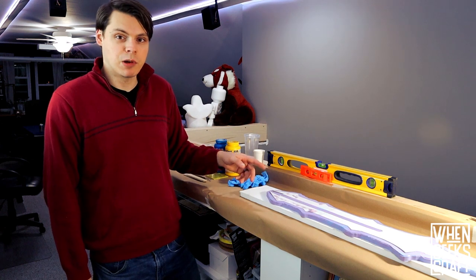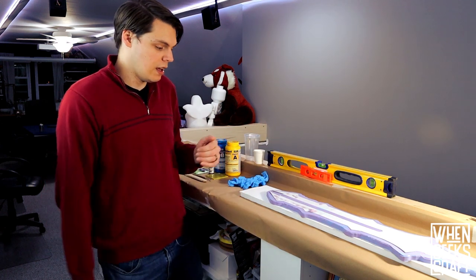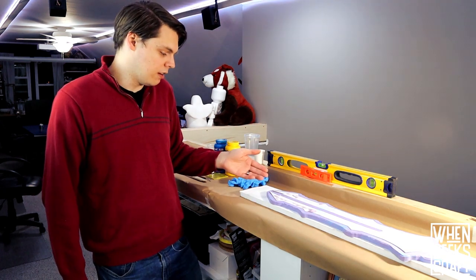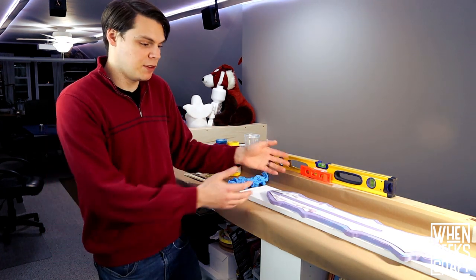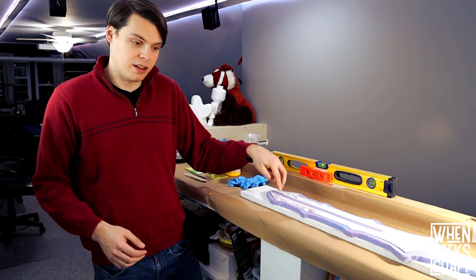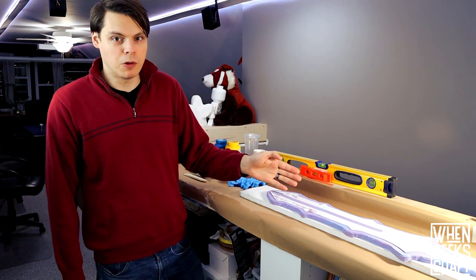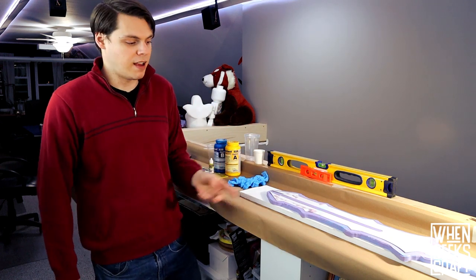We have the 3D printed piece in the mold currently just to keep its form correct. We're doing that because the mold itself is sturdy enough, but if you wiggle it, it's going to move and actually change shape. So if we start with the exact shape from the 3D printed piece, pull that out, and pour the mold, it should come out just exactly like this.